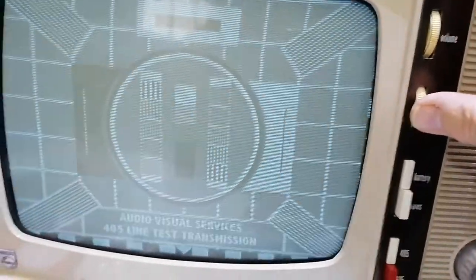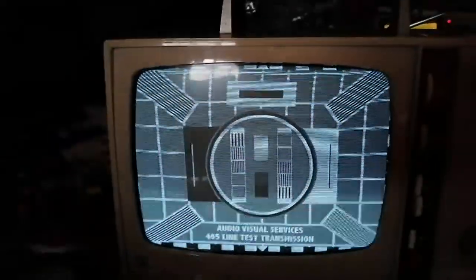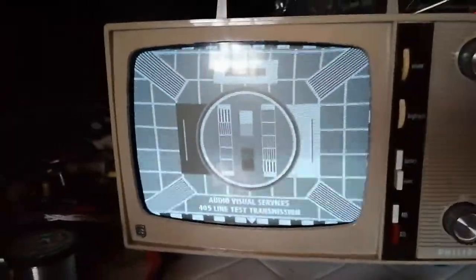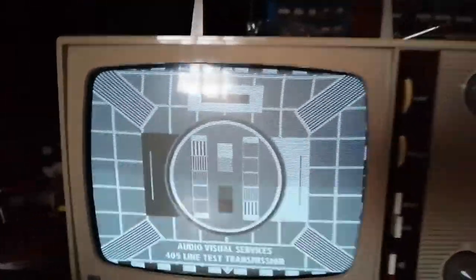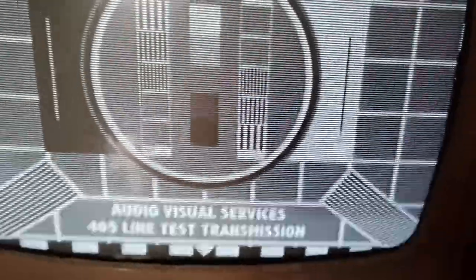That's the contrast at minimum. We'll take the brightness down and see - that's going to help. In fact I might even turn the light off. That's because the light's coming in through the blind - believe it or not it's still light. We can see the gratings in the top of the test card all the way down to the bottom - there's no ringing, nothing. The top is straight. We've cured that issue, so it's looking very nice indeed.